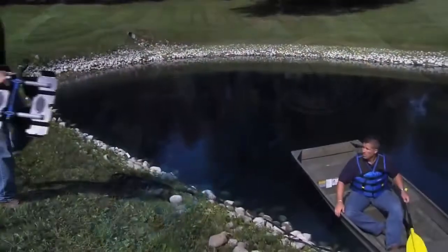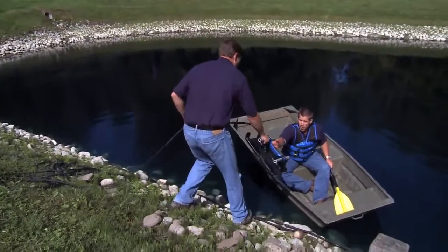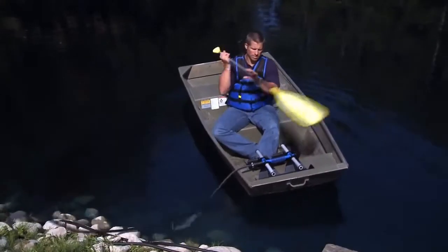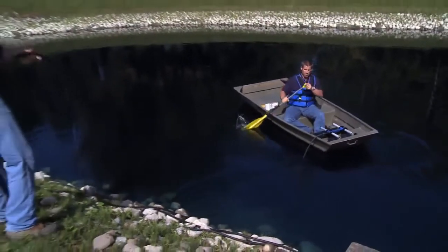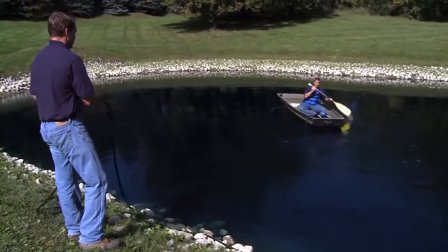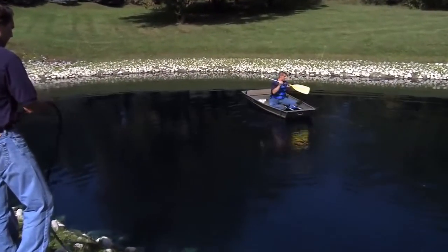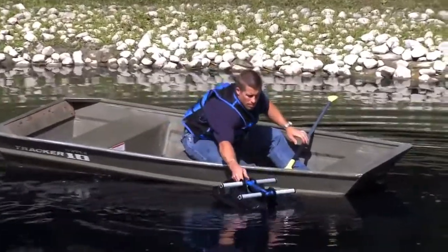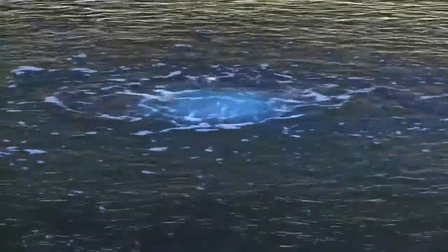The next step is to install the diffusers. The first option is to use a boat or raft. One person sits in the boat and the second person hands him or her one diffuser with a connected EasySet Airline. As you begin to row out to the diffuser placement area, the person on shore guides the airline. Avoid any twists in the airline, as this may cause the diffuser to move away from the intended area when released. When you have reached the placement area, simply release the diffuser into the water. The diffuser is weighted and will require no additional weights to sink. With the system running, you can easily watch to see if the diffuser shifts underwater. Once you are comfortable with the placement, repeat these steps until all diffusers are in position.